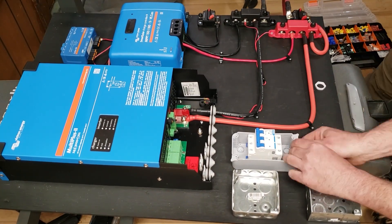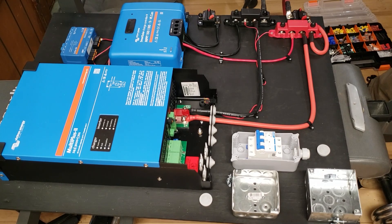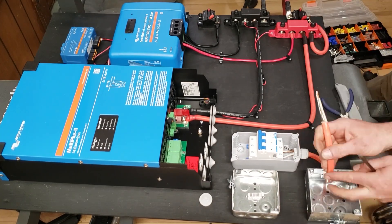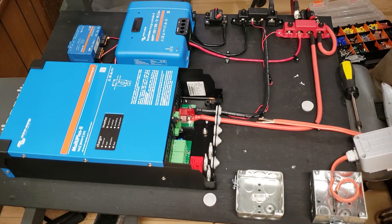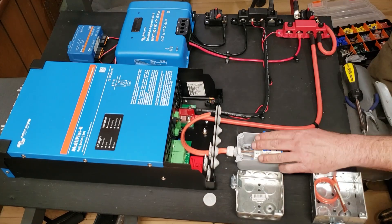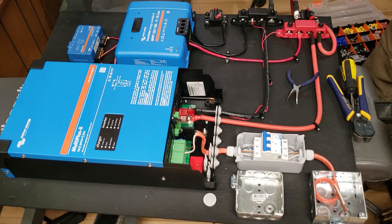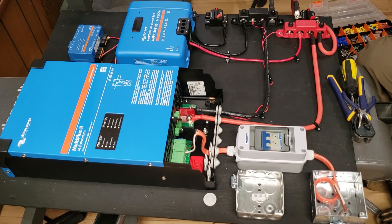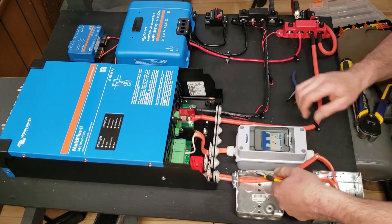Then I used a three-wire resettable fuse — basically a breaker in a little case by itself — as a disconnect from incoming AC power to the unit. So if you're going to be plugging in a generator or connecting this to your house, it's going to be the incoming power to the MultiPlus II that can be used to either run devices or charge your battery using AC power or a generator. The Romex I used is actually a 10/3, which can handle 30 amps. The MultiPlus II is capable of delivering and running off 30 amps, and that little breaker is also rated for 30 amps.